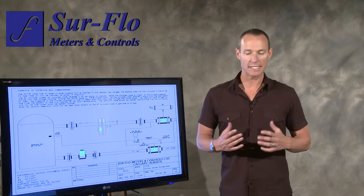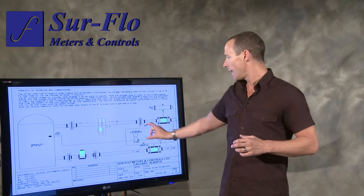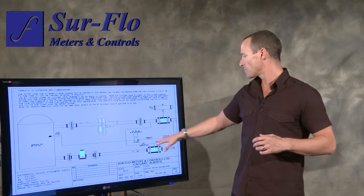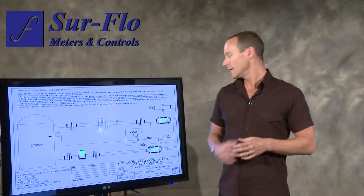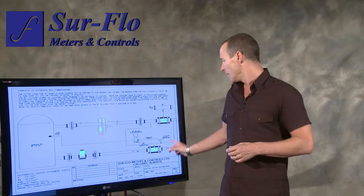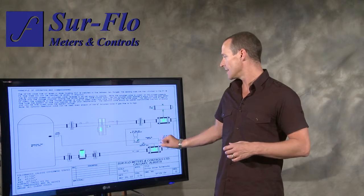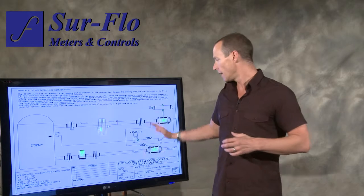All it does is receive a signal to fully open or fully close. So again, we have a little regulator in there, it regulates the pressure down. We have a little controller in there, and it's a fail close. So under normal conditions it's in a locked position. When it's locked up, of course, all that gas is, and we usually like to use gas because we get a lot better control on the control side.